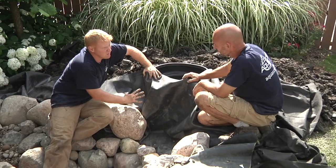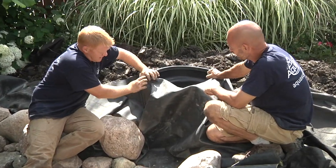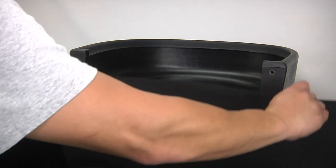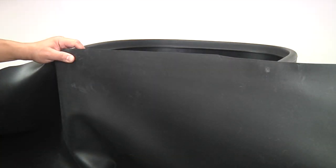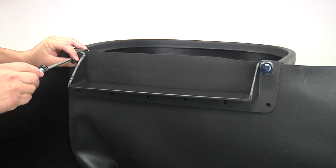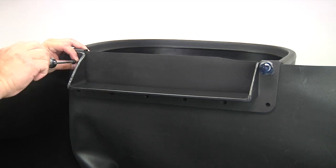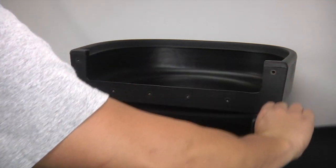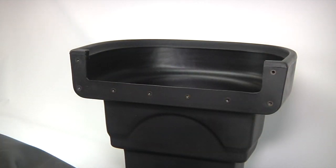With the larger framing rock set in place, prepare to attach the liner to the biofalls filter. Much like installing the skimmer faceplate, temporarily attach the liner to the biofalls with the biofall snout and screws provided. Once the top corner screws are lined up, pull the liner back and remove any dirt or dust from the face of the biofalls and the back of the liner.